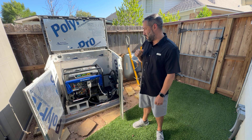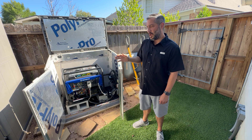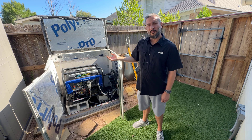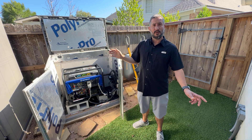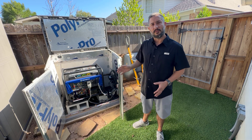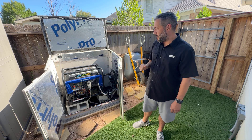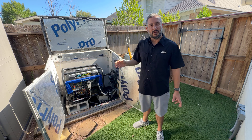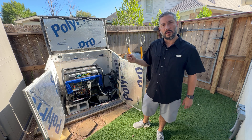On oil: after you get through your break-in oil and switch over to normal oil, I'd suggest switching to synthetic oil, but don't run more than 50 hours on it. Change it at or before 50 hours. It's not always convenient — you might be right at the end of a storm when power is about to come back on — but go ahead and do it.